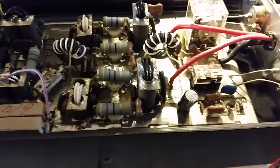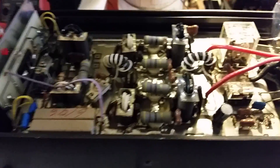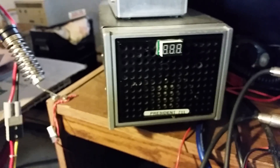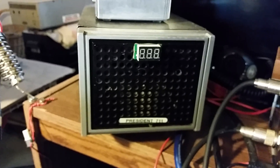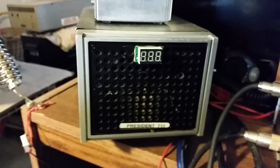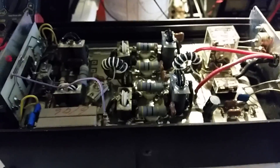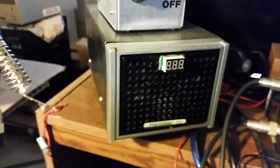All the transistors were blown — somebody hooked the power wire up backwards. I replaced the diode right there that was blown when they did that. Now let me introduce something new to the arsenal. I've got a 200 amp supply over there, about a 40 to 50 amp unregulated supply that floats at 16 volts, a Mr. Real Deal DC Power 100 amp unregulated, and my 35-36 amp supply. This is a B1 bias amplifier so I didn't really want to hook it up on the unregulated.